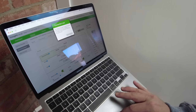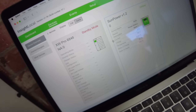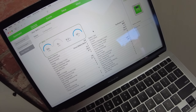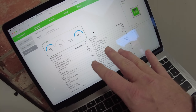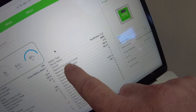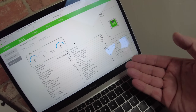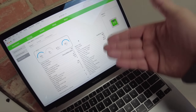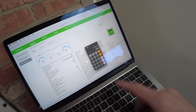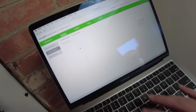On the dashboard we can see the inverter showing up and the battery bank showing up. It shows two batteries but aggregates the data as a single battery. The maximum discharge current is 180 amps with two batteries — one battery alone would be 90 amps, two batteries gives 180 amps, and a third battery would bring it to 270 amps. The battery works great.